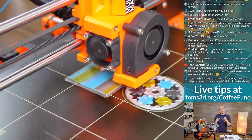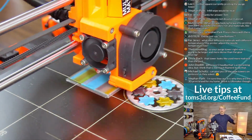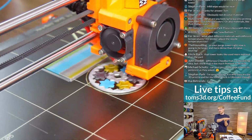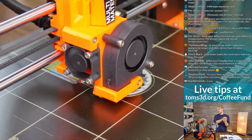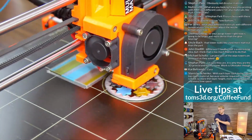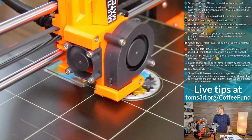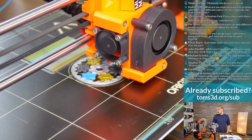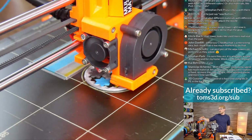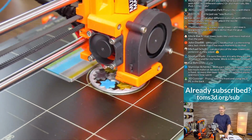So infill is rather fast, perimeters are a bit slower, outer perimeters, the ones that are going to be visible, are very slow. Top solid infill, the solid infill on top that you're going to see, is also slow, but solid infill that you're not going to be able to see is printed faster. So it's a very wild mix of speeds, but it usually works out very well, and prints most things at their optimum speed, where you get good resolution, good print speed, but don't see any of those artifacts that arise from printing too fast. So